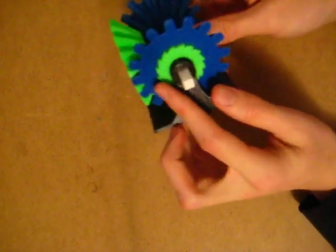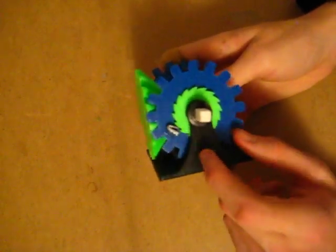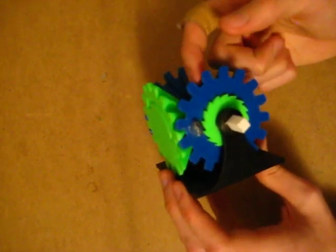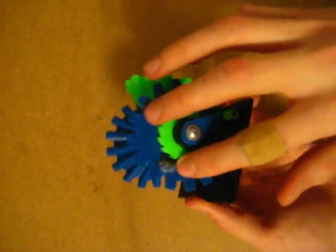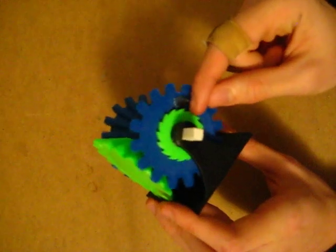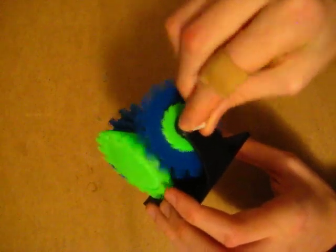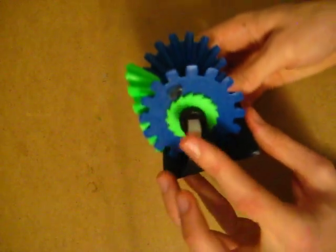So how this works — first I'm going to tell you how it's made so then you'll understand how it works. We have a ratchet over here. Can you see how it's bent? And that is connected to this bevel gear over here. On the other side we have that as well — our ratchet in there. It looks kind of hard to see because there's some glue gun there; I'll explain why that is there later on. On our axle we have these green pieces which are directly connected. It's got a square hole in the green piece so that when you turn the axle it turns that. Well, these bevel gears have a circular hole so that they can freely rotate around this square axle.